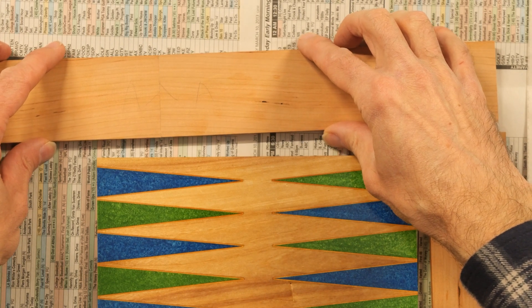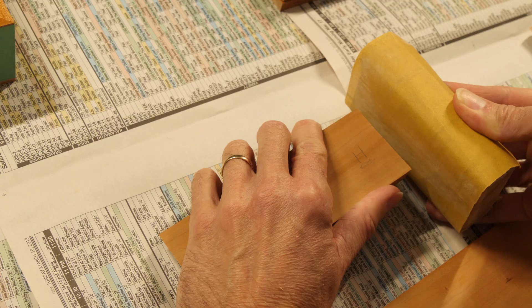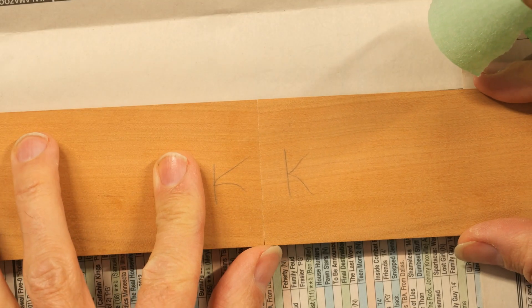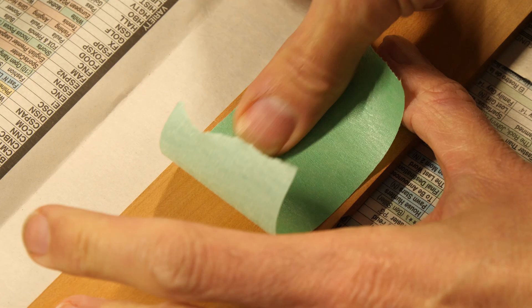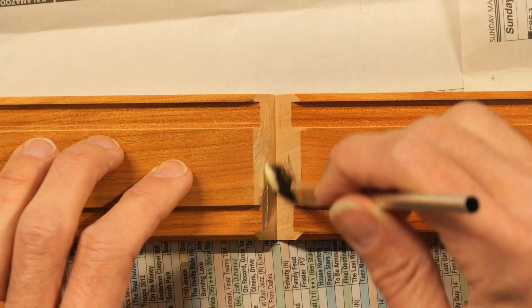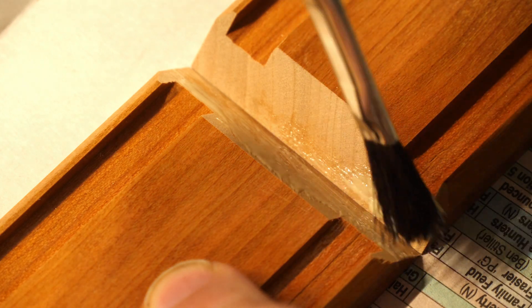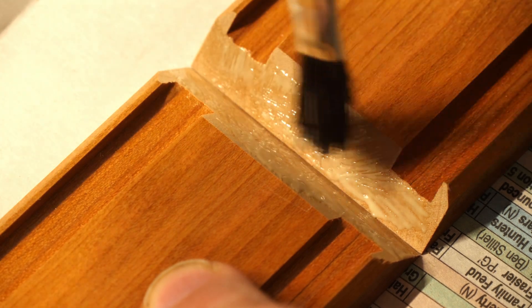As I cut out the side pieces, I gave every corner a unique letter so I can match them up and not get things mixed up. If I match the adjoining corners, the grain of the wood is going to flow smoothly across each corner joint. Before I glue the corners, I'm going to slightly flatten off the sharp point of each miter — that's going to help me get a tighter glue joint. I'll carefully push each joint together, make sure it's aligned really well, place a piece of tape across and rub it down. I'll brush glue sparingly into each joint. It's possible to get a stronger joint by first coating it with a diluted glue-and-water mixture, letting that dry, and then applying the glue a second time so it doesn't soak in as much, but I'm not too worried about joint strength at this point because I'm going to reinforce it with splines.